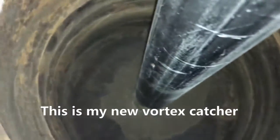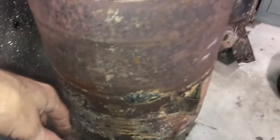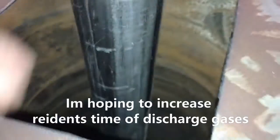I got lucky and was able to just go right into the threads of the old elbow. I think I'm gonna cut it down to about right here. I don't want to go too high up, and if it does something weird as far as some localized heating or some type of inefficiency, I'll go ahead and take it back apart and cut this down lower. But I think we're gonna go with this lowest line right here, so that if any debris flies in the tangent it will most likely just end up in the bottom there.